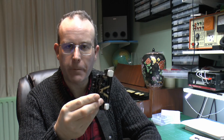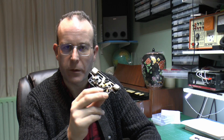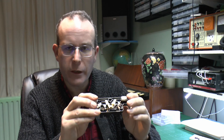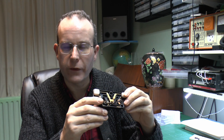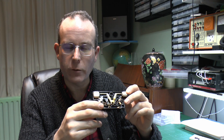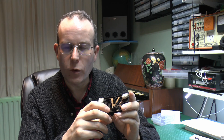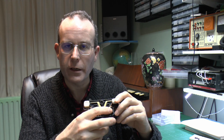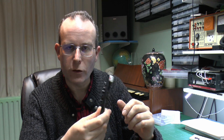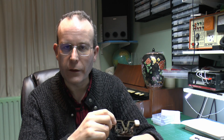So looking at that Australian socket — obviously it's been made down to a price, but it's not terrible construction, fairly typical of what you'd see in quite a lot of sockets in the UK. Now if it had been turned off before the plug was pulled out, that would have actually prevented the problem, because it would have disconnected the active from the other pin so there wouldn't have been an arc. However, the point is that it shouldn't have pulled out like that in the first place. And even if you had pulled the plug out, you may have found that when you subsequently switched on later the fault occurred anyway — so definitely something had come adrift in there. Normally just removing the plug is a perfectly fine thing to do, but of course not in this case.